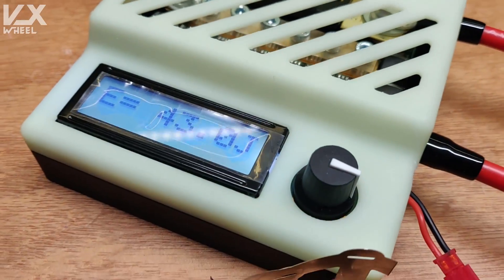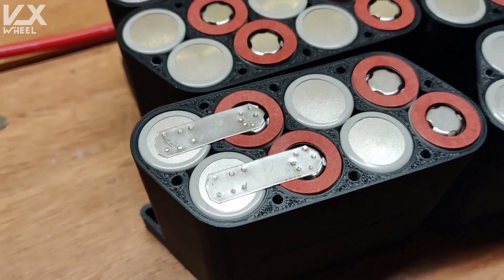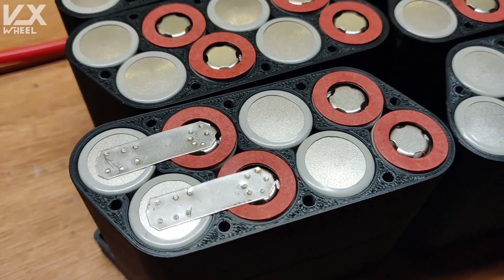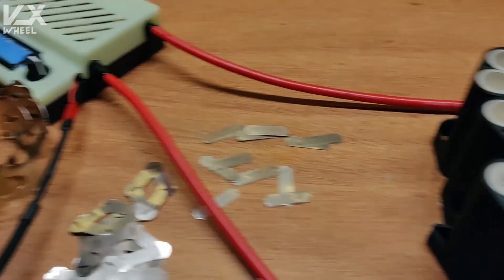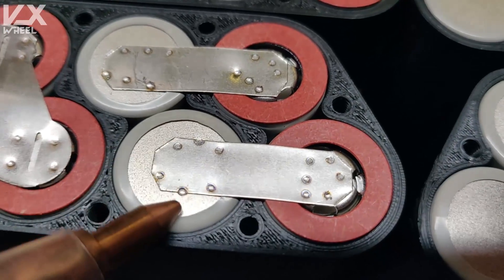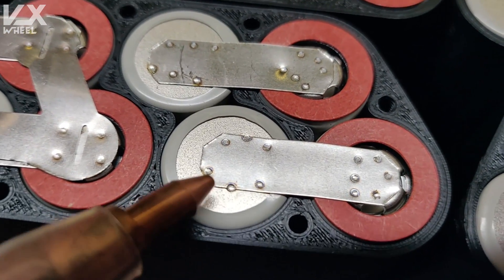I have the K-Weld set at 43 — just for reference, but don't just use the same setting without trying, because every battery, every nickel strip, every setup is a little bit different, so try what works best for you. When you remove a good weld, it shouldn't be easy to remove — and once you do remove it, you can see it makes a hole and a piece of nickel stays on the cell. This means we have a good weld. If your tab just flies off and no nickel stays on the cell, it's definitely a bad weld. If you get holes in the nickel strip before you tear it off, it's too much. Don't weld in the center of the negative terminal.